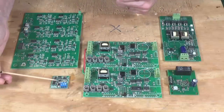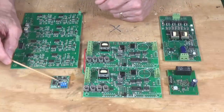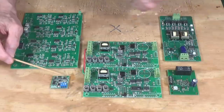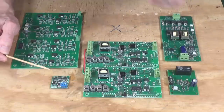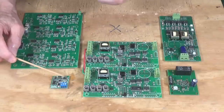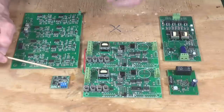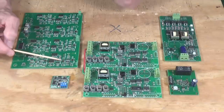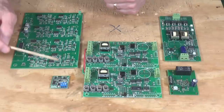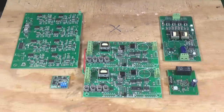The frog juicer and the DCC Specialties Frog AR: the frog juicer will correct the polarity at your frog if there is a mismatch when the turnout is thrown one way or the other. But again, it depends on the wheels of your locomotive hitting that frog and causing a short circuit. Very quickly it will sense that short circuit — the Frog AR works the same way — and they will internally flip the polarity to that frog, allowing everything to continue running fine. But there will always be a short circuit in order for these to operate properly. Those are the limitations and the problems.